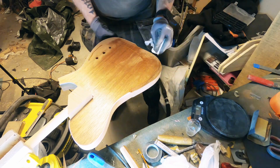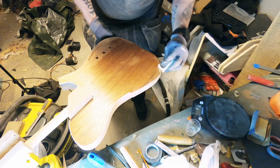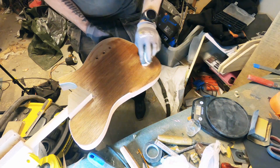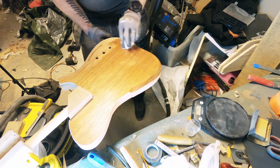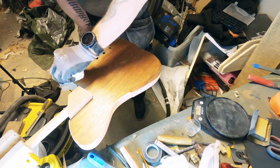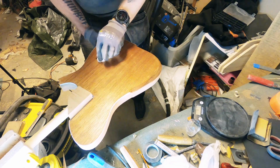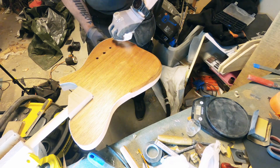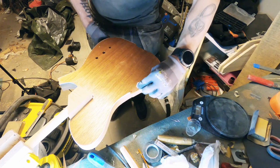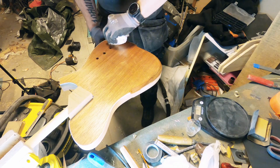I don't want to mix 2 different batches of epoxy, because if you mix 2 different batches of wet epoxy and the hardener is mixed differently, it can start to boil. Or you have to mix it pretty badly wrong, but it can happen.